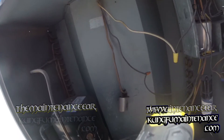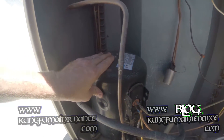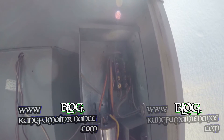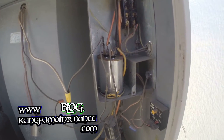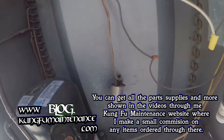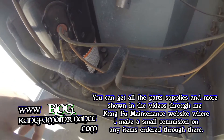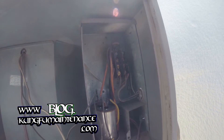Fan motor is running. It's only like 115, 112 maybe. The wiring appears intact. Compressor does not feel hot, so that's good. Contactor points look a little burned. Capacitor looks way tired. Looks like the capacitors have been definitely replaced before. That contactor seems suspect.